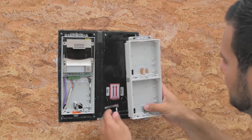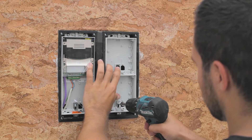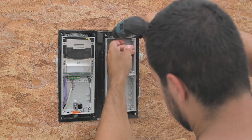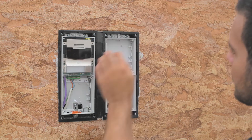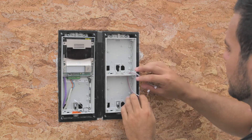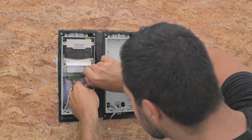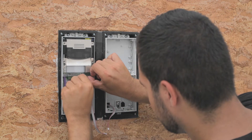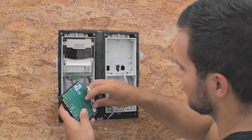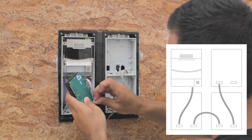Insert the fixtures and pull the VBUS cable into the bottom box. Tighten the three screws, keeping the module boxes centred within their back box. Then push another VBUS cable through the newly made hole, and the last VBUS cable goes into the Verso main unit. Once you've got this prepared, you can start connecting your modules. The order in which you chain the modules doesn't matter, but we recommend plugging the cables in this way.